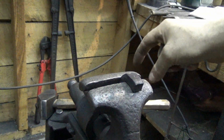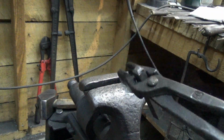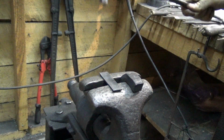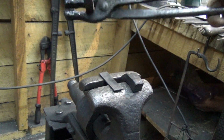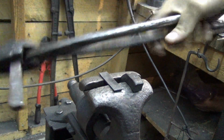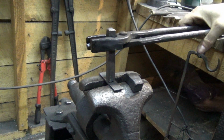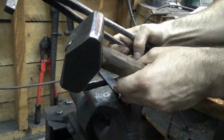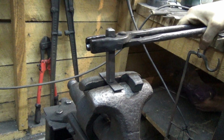Okay, I have a 3/4 inch spacer in the vise. Here's my blank, 2.5 inches long. I have a 1/2 inch square bar. It's gonna be my mandrel. I'll just line that up like this. And I chose 3/4 because 1/8 inch plus 1/8 inch is 1/4 plus 1/2 inch is 3/4. So I will just about clear the vise jaws going through with this. I'd make sure to line up your mark as you're setting up. It's very important.